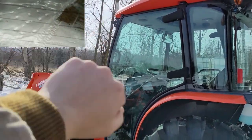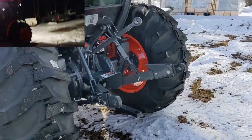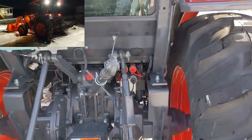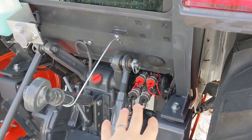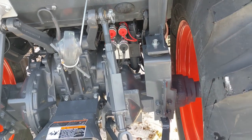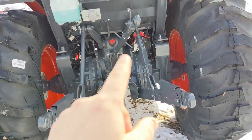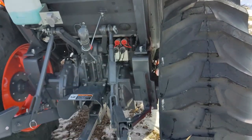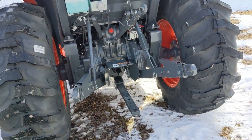I didn't get the side mirrors — that one on the inside works great so far. In the rear here I had some things added. There's the trailer connection and rear remotes. One thing I'm a little unhappy about is Kubota didn't have their standard rear remotes in stock, so my dealer added Summit hydraulics, which made them power over electric. The Kubota ones use the power beyond and it looks cleaner in the cab. This does come with the added benefit that I can switch to constant flow — push the button and have it push out. The constant flow that Kubota has is actually just a float for the rear hydraulic control, so it's a blessing in disguise.